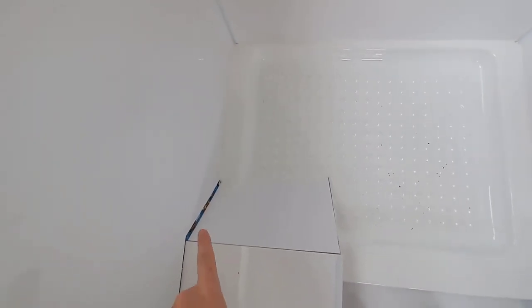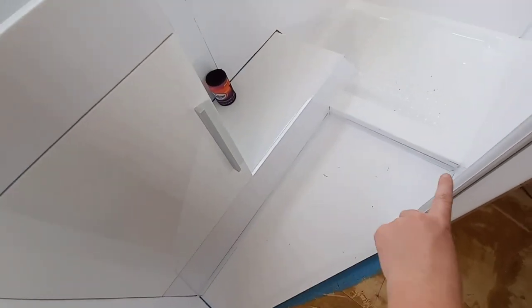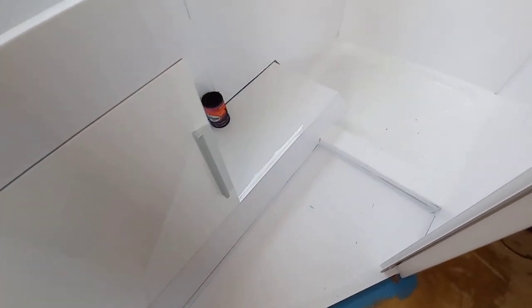As you can see, this is just a bit of a video closer up so you can see the silicone job. So I've done all down the corners and the roof. I've left those little bits in the corners. I just want everything to dry first so that I don't smudge how perfect the line looks, and then I'll go back and silicone over where the corners do join together. We then also siliconed the bottom edge of the shower base as well, so that's all looking nice. We still have to do the metal edging just along those side bits of the wheel arch, but that's what we're up to now. And then I also have to do the little part just on the outside part of the shower base, just that little bit with the white angle all around the edging down there, and then that part's completely done.